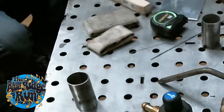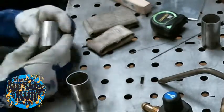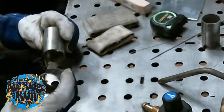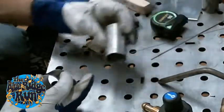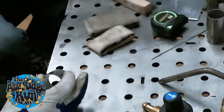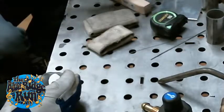You want to weld the material thickness, or the better part thereof. So you want to see almost the face of that wall thickness to where you're going to lay your weld in. And then that essentially creates the same principle as your bevel on the pipe. You're creating that valley to fill with weld rod and create one piece.